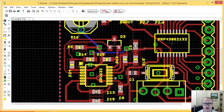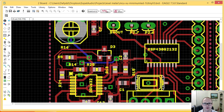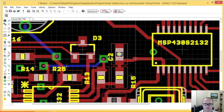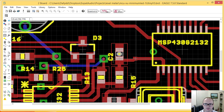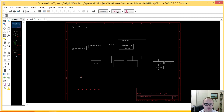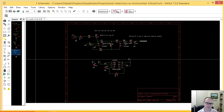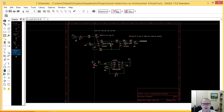Now, the only place I actually bring out that precision rectifier point, and I'm kicking myself right now, is at this point right here. And this looks like a test point that is only on one side of the board, so that's really annoying. Looking back, I really should have created a through-hole point that I can test with. So the challenge is now, can I see what my test signal is from underneath the board? Because ideally, what I want to be able to do is plug this board on top and test that point.